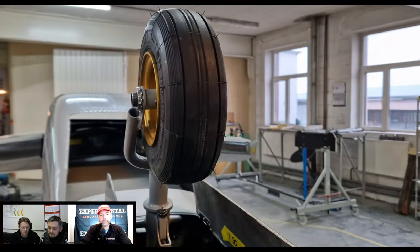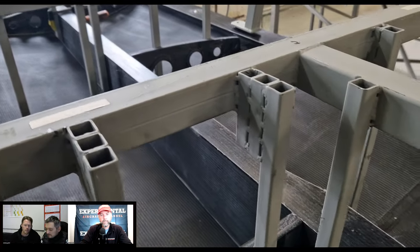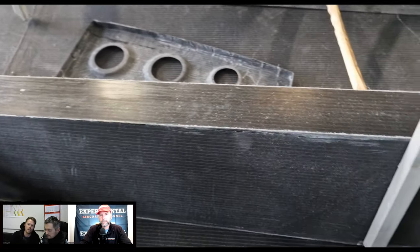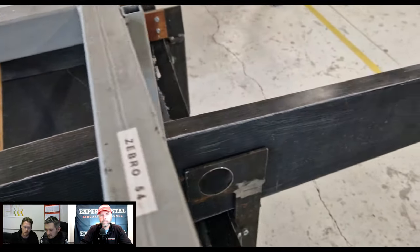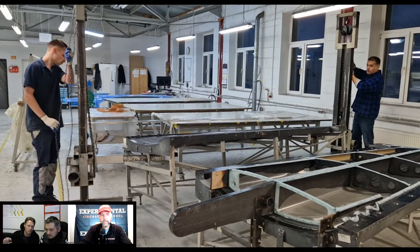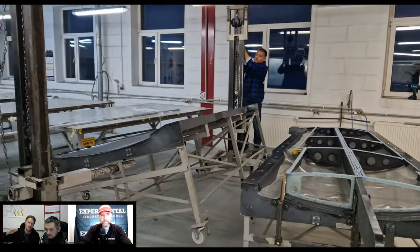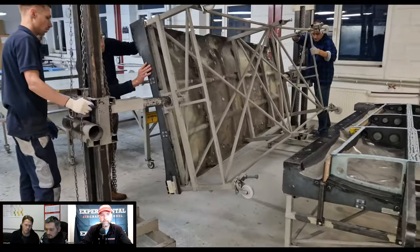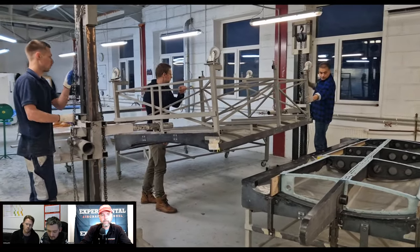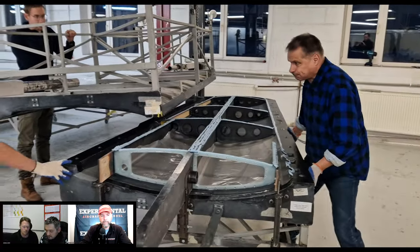Right. So what we learned here from the processes, working together with the Polish Civil Aviation Authority. So we're following a lot of the standards that you can find in the certified aviation world. So CS-23, Amendment 5, or also Part 23. Standards of quality control. What does it mean? We take samples, resin samples, for every piece that we produce. We do data logging of all the temperatures, of course, for the temper and curing processes. For every kit that we build, there's a big folder of documents that have been quality controlled with the corresponding samples, etc., so that we can trace back every little piece that we installed and how it was done in what atmosphere and conditions. So these are processes that you usually follow in certified aviation. So that's what we do.